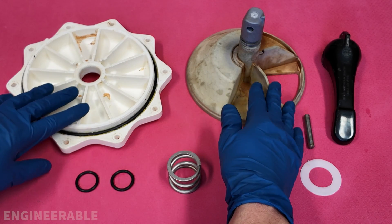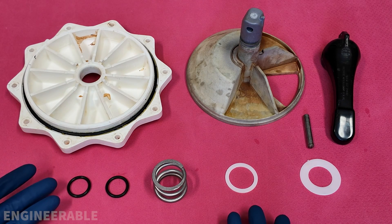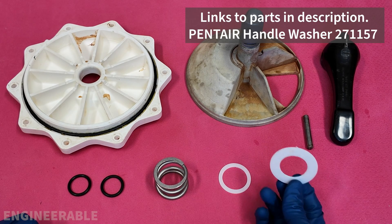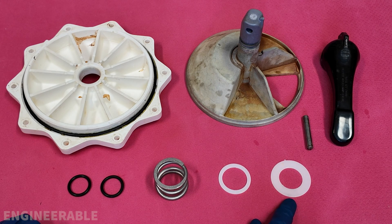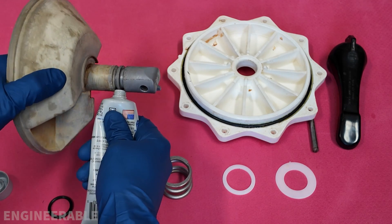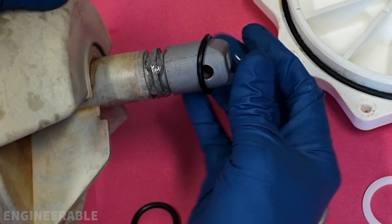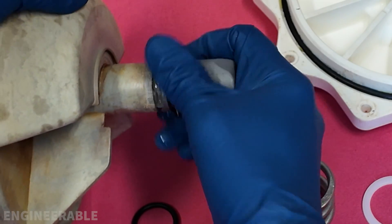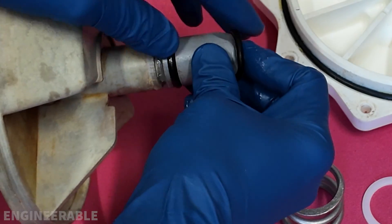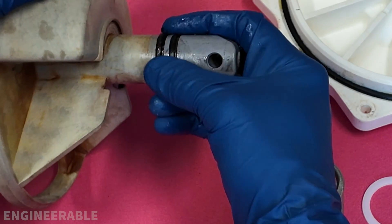Once the cover and the diverter have been cleaned up and you've removed as much rust as possible, it's time to take all of the replacement parts and reassemble everything. The replacement parts you should have are two new o-rings, the replacement spring, the spring washer if yours is degraded or missing, and the handle washer. If your spring washer and handle washer are still in good condition you can reuse them. Use a little bit of silicone grease when replacing the o-rings — squish some silicone grease into the grooves, put the first o-ring back on, rotate it to get grease all over it, then put the second o-ring back on and do the same.